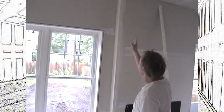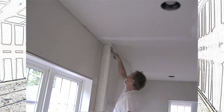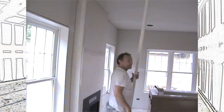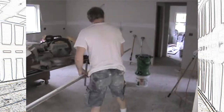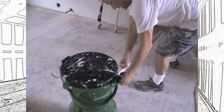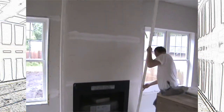This is the homeowner's way of doing this. The reason I'm saying that is because what I have to put corner bead on, I got a hopper. A hopper makes this that much easier — it's really easy with a hopper. This is the hopper here. What you do is you slide it through; it muds up both sides and comes right out like that, nicely full of mud. Then I can take it and put it in place.